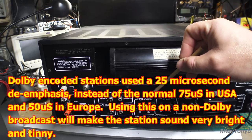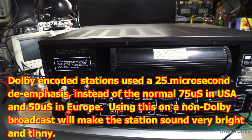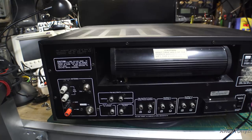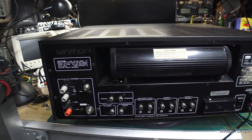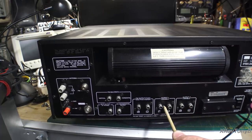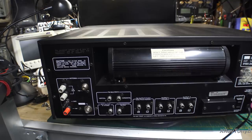So this is actually Dolby FM. Dolby used a special FM de-emphasis which I don't think is being used anymore. The Sansui 9090DB, the Realistic STA-2100D or 2000D — those all had Dolby FM built in, and that was common in the early 80s. In addition to the Dolby output, there are the discrete output 1 and output 2 that can be assigned to either the FM or the AM tuner section.